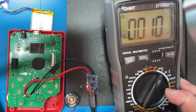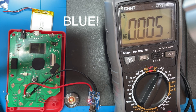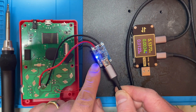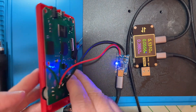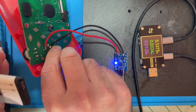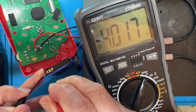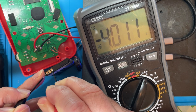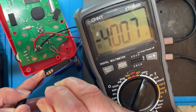This light will soon turn green or maybe blue — it will soon change and the battery will be fully charged. I think our battery is back to life. We're getting a blue light — interesting that it's going blue-red, I've not seen that before on these charging boards. Let's take the battery out and measure the actual voltage. Hopefully we should have around 4.2 volts — we've got 4 volts, not too bad. I'll keep an eye on this; it seems to be going down slightly. Hopefully it isn't going to go down forever — I'll leave it for an hour or so and see what voltage we've got.